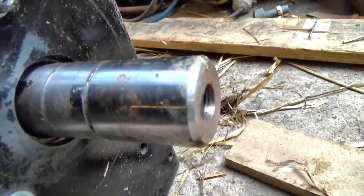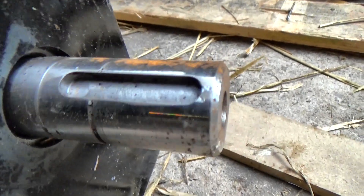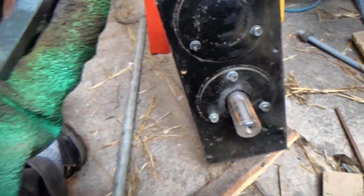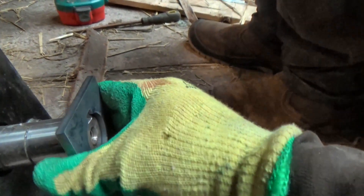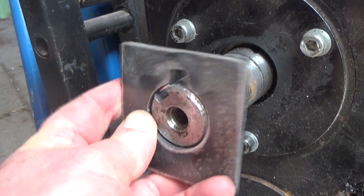The pulley has to fit onto this shaft. It's a 35mm shaft, but if you cut a 35mm hole with a plasma cutter, it will usually be slightly too big or slightly too small, depending on things like the newness of the tip. So I'm starting by making some test holes in small squares of steel, experimenting with the drawing till I've found a snug fit.